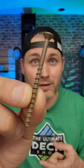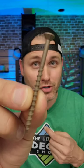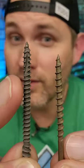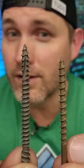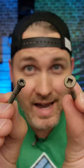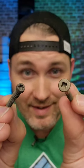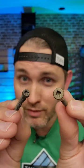One of the most gruesome things somebody can do with their new composite deck is use the wrong screw to fasten it. This is perfectly fine if you're installing a pressure treated deck, but this here is a composite deck screw. The first thing you'll notice is this little tiny cutter groove on the end of the screw. The next thing is the head — one is a Robertson, you might see Phillips more often in the United States, and the other is a Torx.